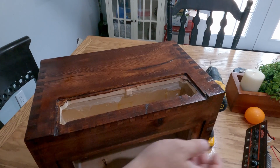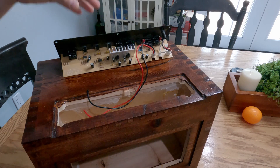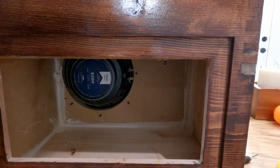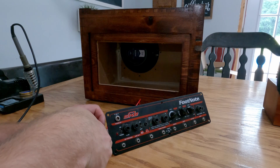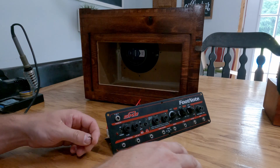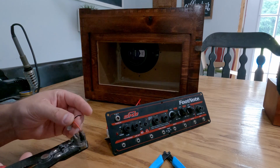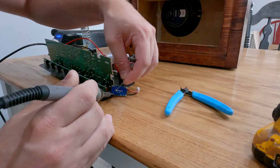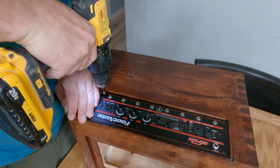Everything seemed to be going very well, but I still needed the amplifier portion of it. That's where Parts Express came in. I was searching the Parts Express website and came across a buyout they still have going on — for this footnote amplifier. It's a small bedroom amplifier, but it also does foot pedals, which was pretty cool. The problem was it only ran on 9 volts, which wasn't a lot of wattage. After researching the board a little, I found that this amplifier can actually go up to 12 volts. The problem? The foot pedals can't. So to rectify that, I added a step-down converter between the board and the foot pedals, stepped it down to 9 volts. Now I can plug in a 12-volt power supply, get a lot more wattage out of it, and still use the 9-volt pedals. A win-win for everyone.